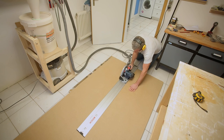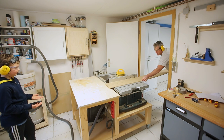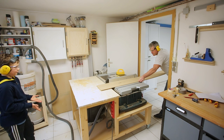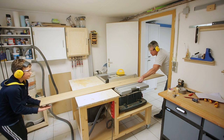I'm going to do this in my living room, but since I don't know exactly how it'll look or work, I'm doing a test run in my rec room first. Let's break down some MDF. My shop is too small to run an entire sheet through the table saw, so I break it down with the track saw first. Even then I need to position the table saw running it through the doorway. I'm using 9mm MDF and start by ripping the base pieces for the center beams at around 11 centimeters wide.